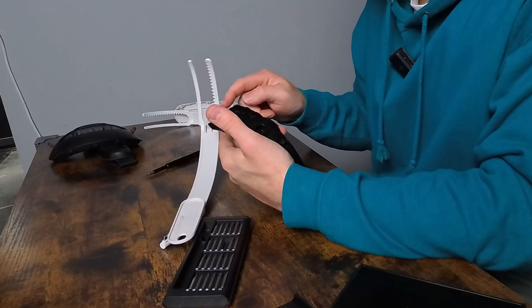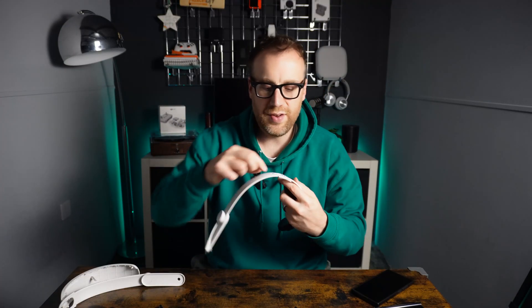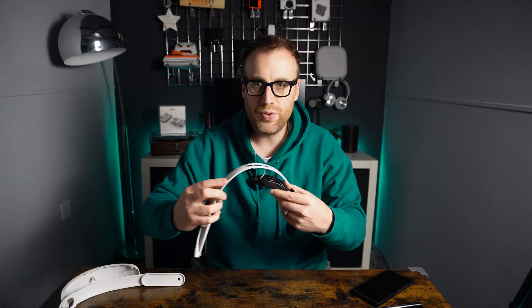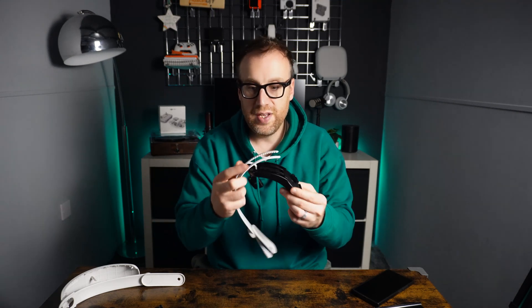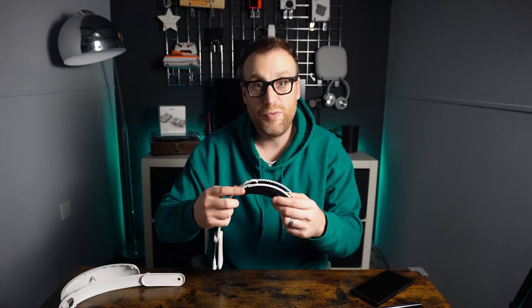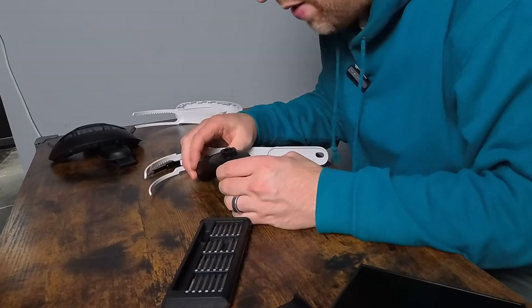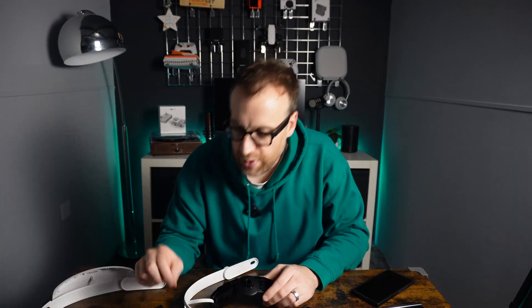You can then see the ribbon cable - the USB-C ribbon cable which comes from inside and then goes down the actual battery strap arm. There's a ribbon cable going down this arm, which gives you the flex as well, allowing the ribbon cable to flex as this gets smaller and larger. Time would tell how long that ribbon cable would last, but I imagine it will last a long long time. There are some more screws in here to get to the battery, so I'll undo those.